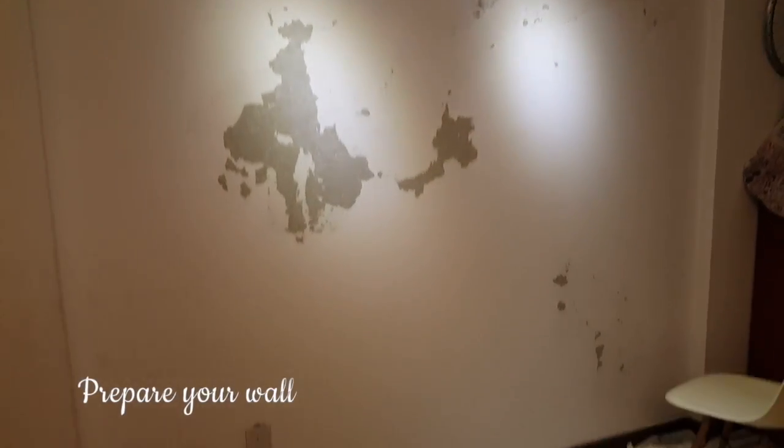If your wall is painted like mine, I recommend to remove the paint as much as possible so that the joint compound can stick better. My paint came off like paper, as you can see. There are easier methods to do this, but I chose to scrape it off the hard way as I didn't want dust flying all over the place. Plus, it was a good way for me to vent stress onto the wall.